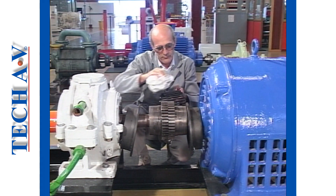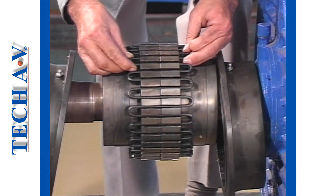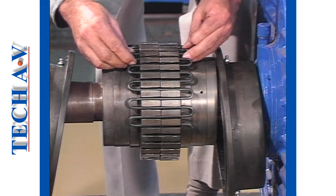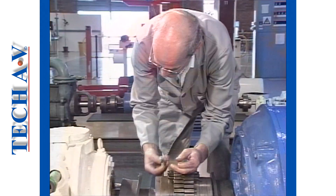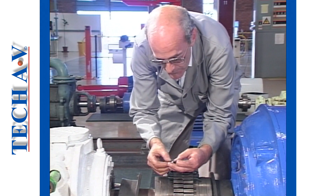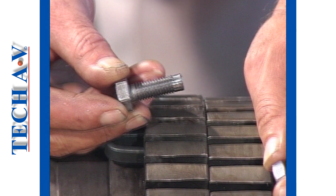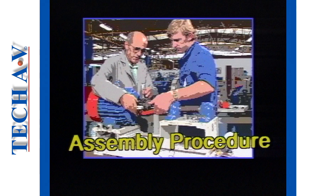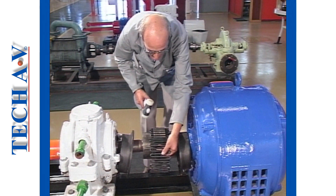When all parts are clean, inspect each component for signs of obvious wear or damage. The spring segments should be inspected for any damage such as cracking. They should also fit correctly into the half coupling slots. Don't overlook items such as bolts, nuts and washers — they may seem insignificant, but a bad thread can cause one to come adrift and bring the plant to a standstill.